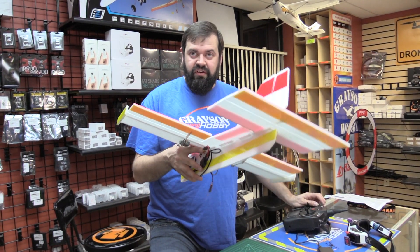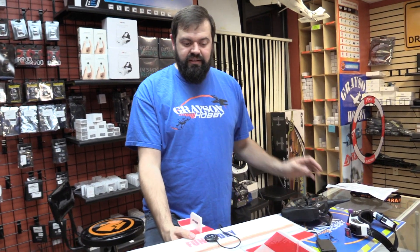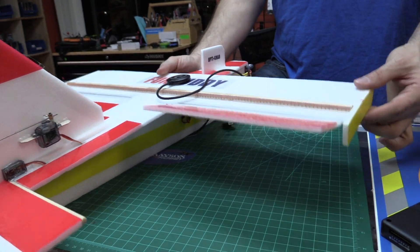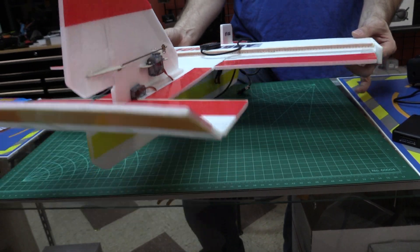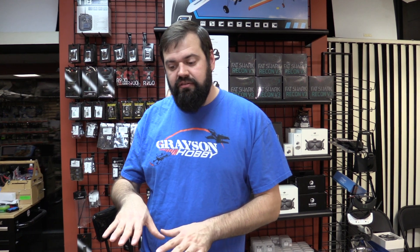Keep in mind there are multiple flight modes. In normal mode you want to set up, take the plane off, get it flying, then flip it to gyro mode. This will tell you if you have any directions wrong. If something is wrong, you can immediately flip back to normal mode, land it, and change the programming without destroying the plane. The third mode is safe recovery — that's your 'oh no, I need to level it back out' mode. One thing to keep in mind: when you are in safe mode or aerobatic mode, you will have what they call servo drift. If you're testing on the ground you'll see this — it doesn't happen in the air. The gyro is always trying to find neutral, so servos will slowly walk. Seeing servos slowly move to one direction and stop because they run out of travel is normal. Don't freak out — once it's in the air, it doesn't do that.